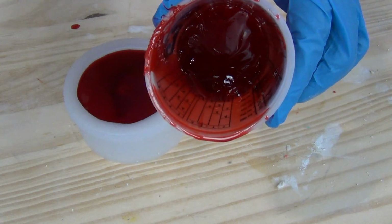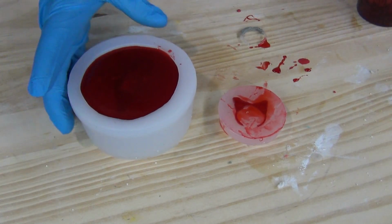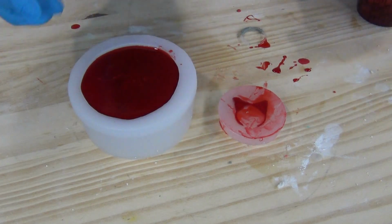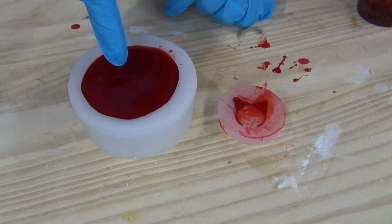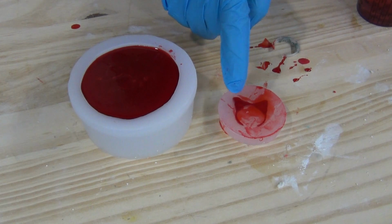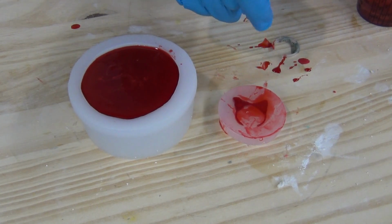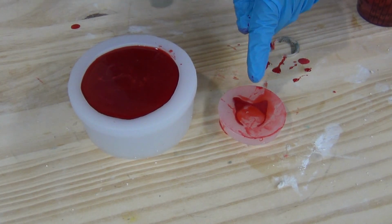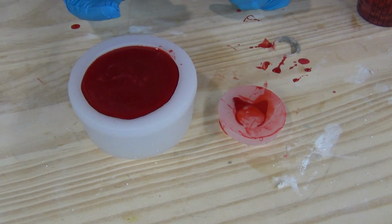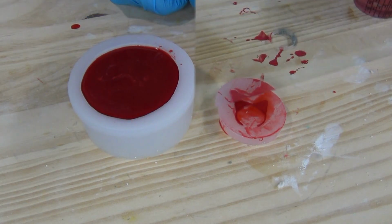And now our leftover resin has begun to gel, and it's going to start to undergo that color change. And real important on this, if you're new to working with these types of resins, remember that they cure from the thickest mass and radiate out. So you'll notice that the thickest part of the ear is going to start to turn opaque and then radiate out from that point. This one is going to take a lot longer, and when that thinnest area has cured and turned solid, and you'll know that by that color change, that's when you're ready to demold your part. So keep an eye on that thin area. That's going to take the longest to set, and that's when we'll know that little piece is ready to demold. But it's the complete opposite of an air drying material. So the thinnest areas will take the longest to cure, the thickest areas will be the fastest.